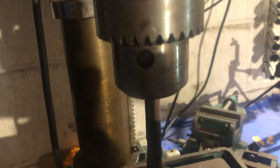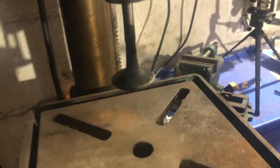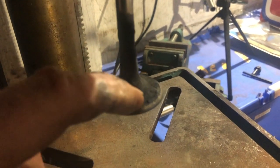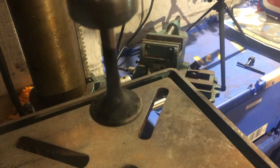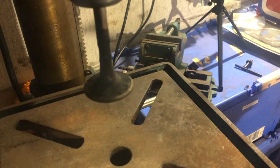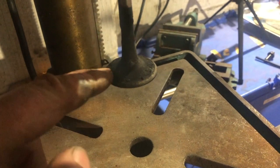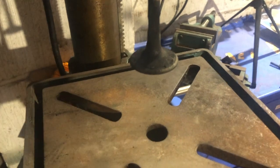It's slightly clamped in the pillar drill and it's on its top speed. The method I've come up with is to use a blunt screwdriver to lay off the majority of the crap, then 600 grit, and then 1200 grit to finish - being careful not to go anywhere near the sealing surface. Makes them look very pretty.